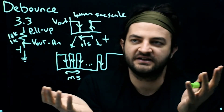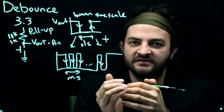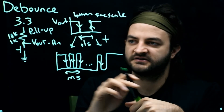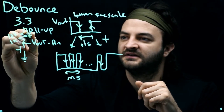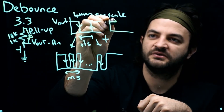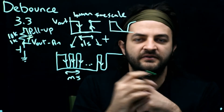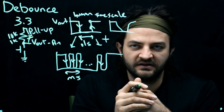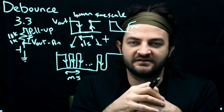There are other things — basically anything that produces a digital signal like this — where we should potentially think about adding debounce. One way to debounce is by adding a capacitor between Vout and power. That means our voltage, instead of changing digitally, will RC to ground when pressed and RC high when released. This adds a filter, which limits the rate at which the button can be pressed. If you push it too fast, the voltage won't complete the digital swing the PIC needs to detect the change.